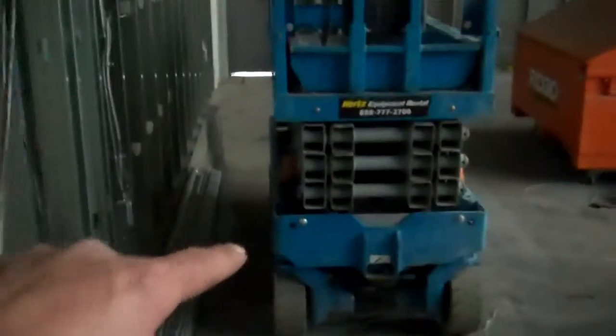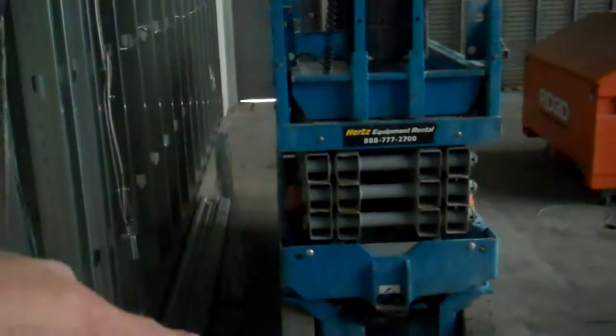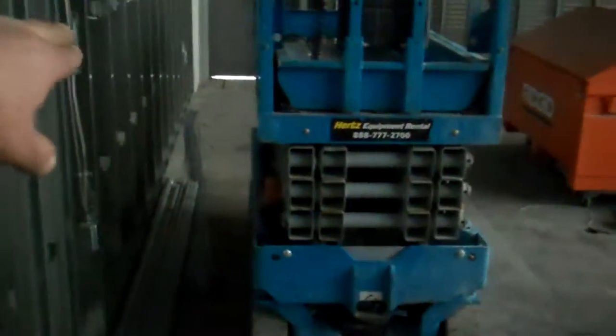Framing's complete. We're waiting on an electrical inspection on the in-wall so that we can insulate and then get that inspected. I'm not sure where to put the counter — I need to find out so I can add an outlet for the counter. I'm assuming this is our entry, so I would think the counter should go along this wall right here. I'm going to add an outlet with a quad, just similar to this, for the computers.